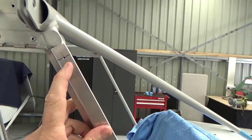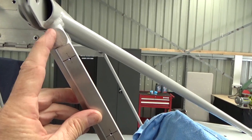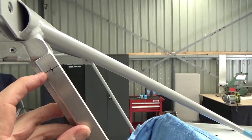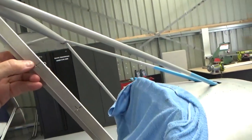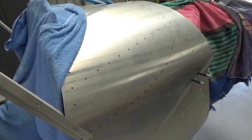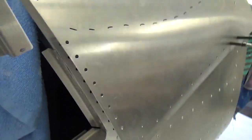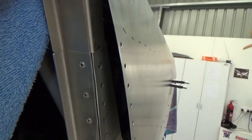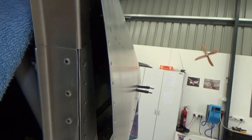Also with N15, like I said before, I spaced out my holes, taking into account the perspex edge distance. I don't get too close, but edge distance to the rear is going to be very critical. Don't get any cracks. So I've just evenly spaced those out. There is 1, 2, 3, 4, 5, 6. I've got seven fasteners, and I've cut N15 off to sit nicely. However, that's flush on the tube, and that'll sit nice there.